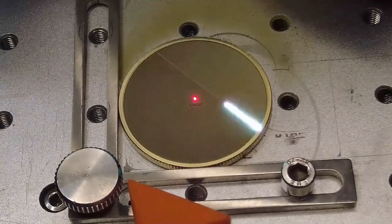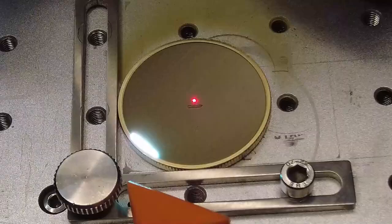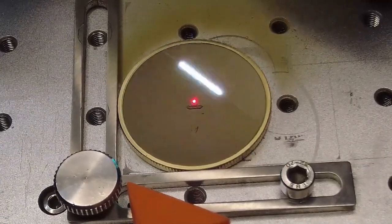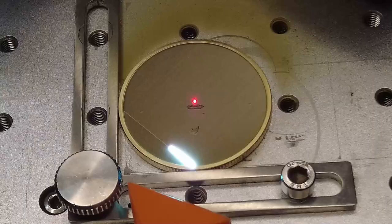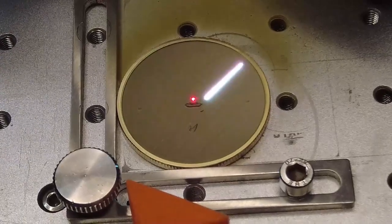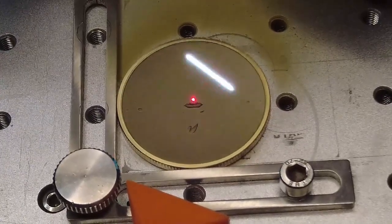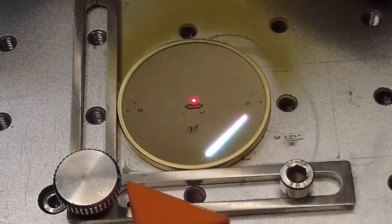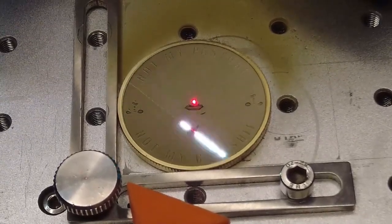Hi, Andy from Great Lakes Technical Service here. This is a 40mm brass coin being engraved on a 30 watt CO2 laser with a 110mm lens. The image is from Brand Laser Designs. I have adjusted the settings to suit from his 50 watt settings and although not as deep, has turned out pretty good.